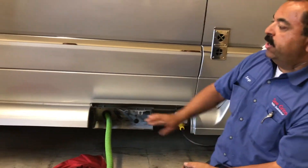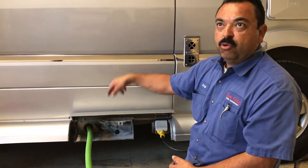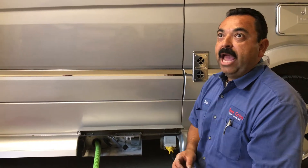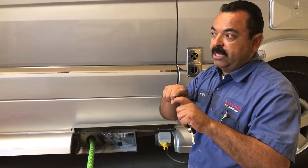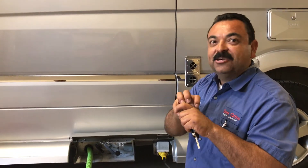The one important thing never to do is throw baby wipes into that tank, because the macerator pump blade — and it's very expensive, takes about three hours to disassemble everything — the wipes actually wrap around the blade and get it clogged.